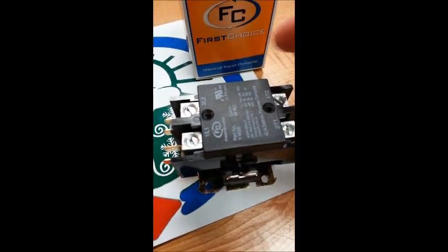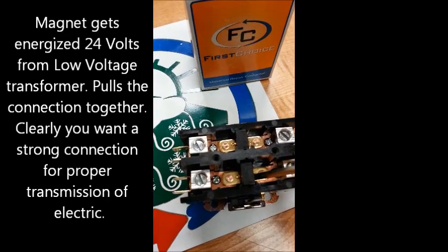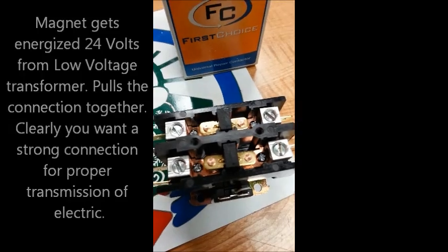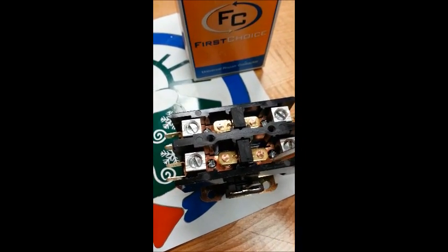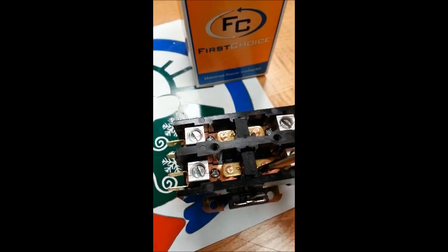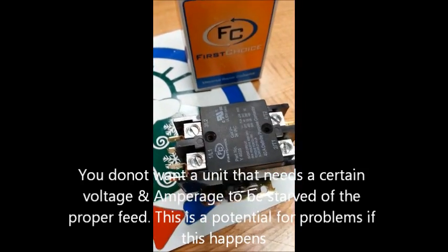I've removed the screws and it pulls right off. What this is are your contactor points. This is pulled up and down by a magnet, so if it's pushed down it'll contact. What we used to see a lot of is ants getting in here — ants are often attracted to electrical fields or will just migrate there for heat. It pulls down, smashes ants, and you get no contact or poor contact, which would just burn something out. That's why they've started to put this cover on, which works really nicely.